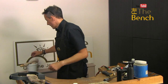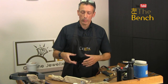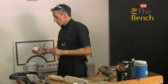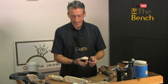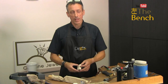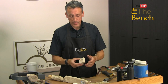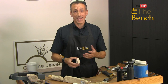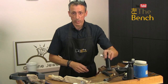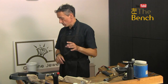I've got a brand new crucible holder. You can get a holder like this one or what's called a whip — an iron or steel whip. In this instance I've got a small square crucible. You can get these round, in all shapes, and larger. The larger the crucible, the more powerful a torch you need. This is about a two-inch crucible, ideal for melting around an ounce to an ounce and a half of silver using the torches I've shown you.